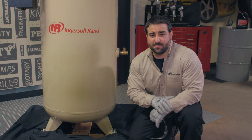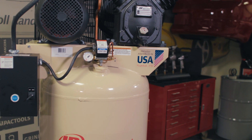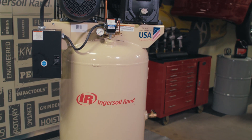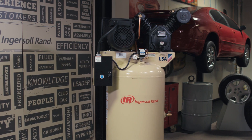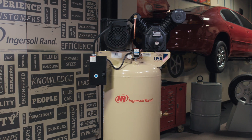Condensation builds on the machine that compresses air — it happens all the time, but especially when operating a compressor in areas with large temperature changes, in high humidity areas, or when not protecting it from the elements. This condensation can build up and cause all sorts of damage in the piping or rust off the bottom of the air tank.